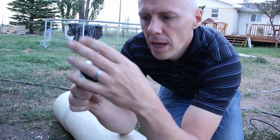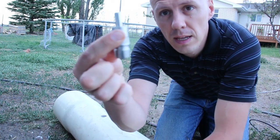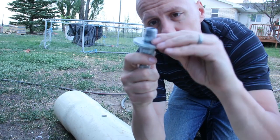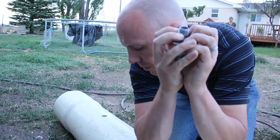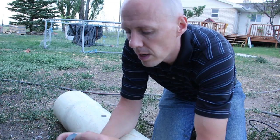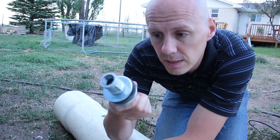For this nipple end — the pig nipple connects to a coupler which then connects to another nipple. I'm going to put a flat washer on the outside and a rubber washer. That will go into my hole, and on the other side we'll have another rubber washer followed by a flat washer followed by another coupler to hold it tight. I've got to go find some Teflon tape to get this all sealed up.